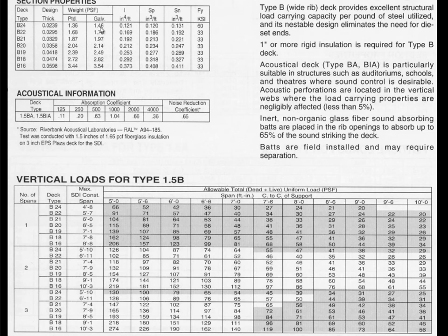Weight is listed in pounds per square foot for both painted and galvanized versions — galvanized is 0.1 pounds more per square foot in each case. Which you use depends on how much weatherability you want. We often drive screws through the roof to hold down the decking, recovery board, and membrane, which can cause moisture condensation and corrosion on the screws, so generally galvanized material is preferred.